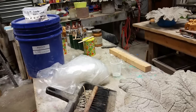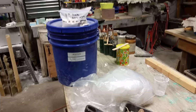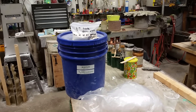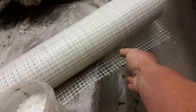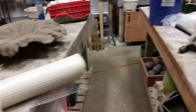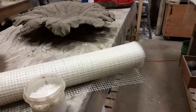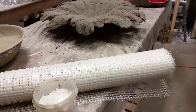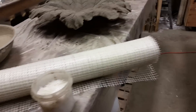So it's quite a bit different. Your mix has quite a bit more cement powder. I use white silica fume, there's a GFRC add mix, and I use these three-quarter-inch AR fibers now and the AR scrim as well. It's sort of a three-layer process: I brush on the skin first — a layer without fibers — then I do a layer with fibers, and after that I do a layer with the scrim, then another topping coat on the back side.